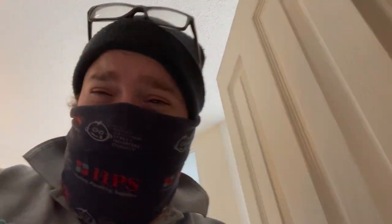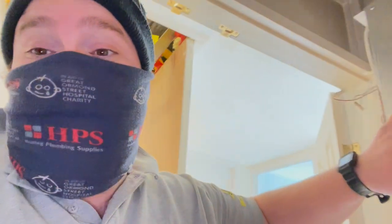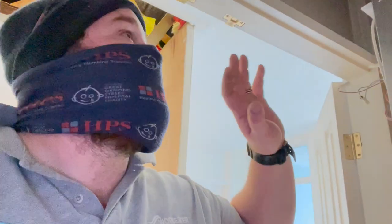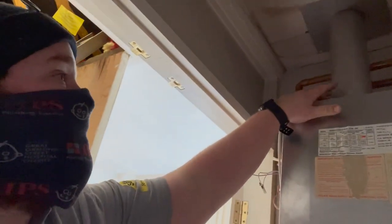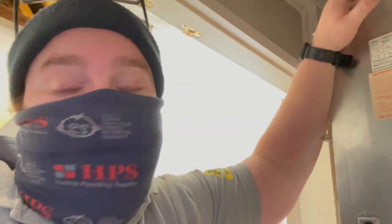I have to sort that out as well. Plan of the day: I've got the roofer coming at one o'clock, so I've got to try and get the boiler off, new one on, all piped up. I'm going to try and basically match it up as best I can because obviously that's where the hole is in the roof. We'll take all the old flue out, new flashing kit in, new flue in from above.